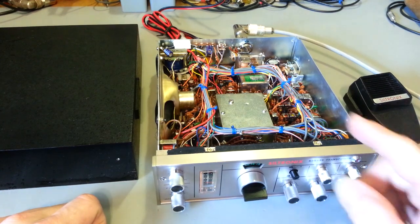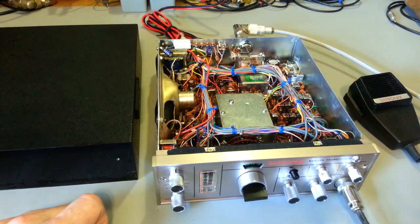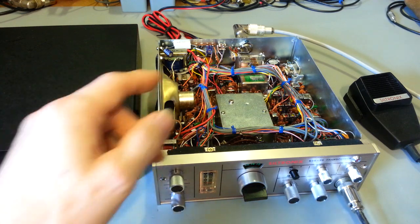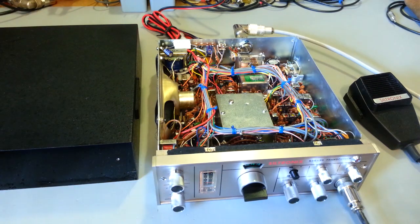The actual problem was the wire had popped loose off of the coax connector. It was still apparently making enough contact where you could receive, the signal could basically jump the connector gap there, and you could still hear some receive, but transmit power, it was a bad connection.